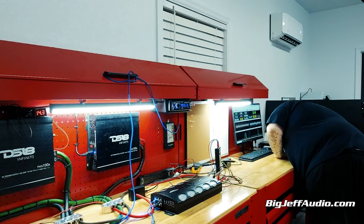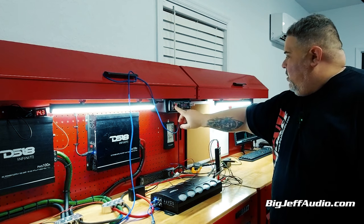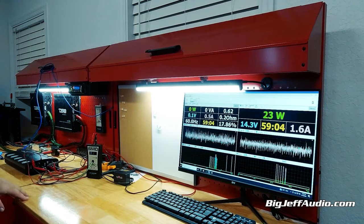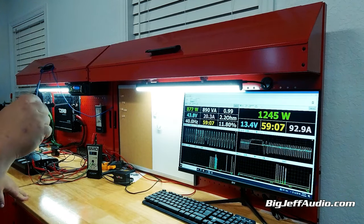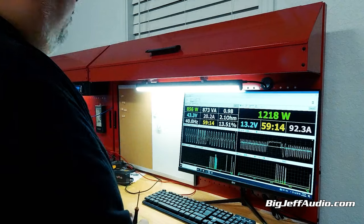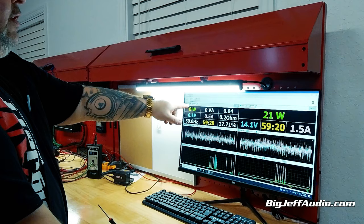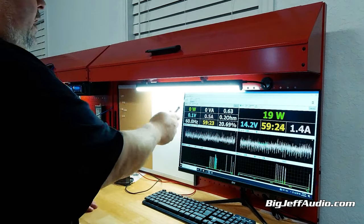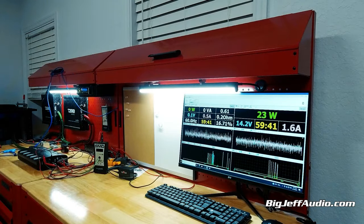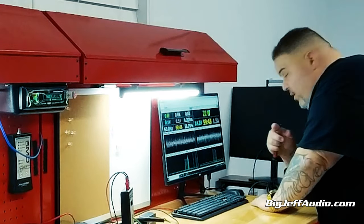Dummy load on. Start the track. Check it out here — it's about to start kicking in. That's about 850 watts. This side is reading off of the power wire, this is reading off of the speaker wire — the actual output. This is AC mode, this is DC mode. So AC at 2 ohms we're getting — I think I saw about that. They look all green.